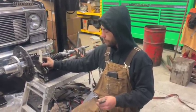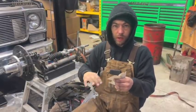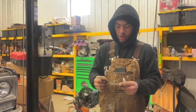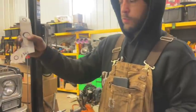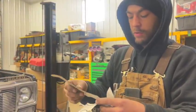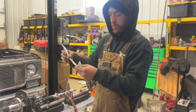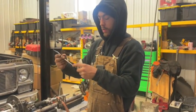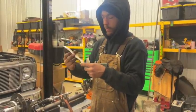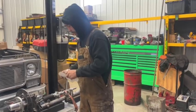So when these get here, all I literally have to do is put these on there, trace it out with a Sharpie, and make my Sharpie line disappear. I'll have to use the plasma cutter and so on and so forth. This is the inner brackets, but they start off just squared here. So I'll transfer this one on, arch it, knock it out. And actually this one's labeled plus 3/16 of an inch, 1/8 inch. So I have to leave a little more material right there. Actually, yeah, probably do. So I labeled all those. So these will literally transfer them over and weld them on.